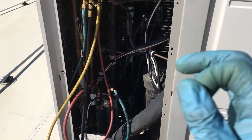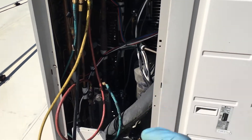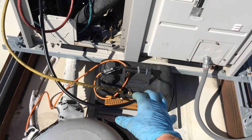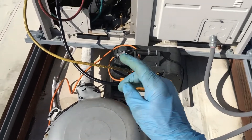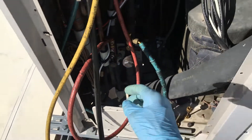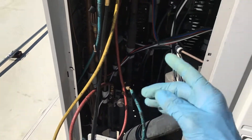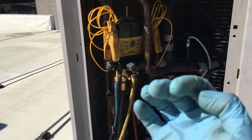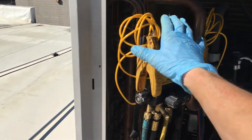But if you want to do a real good job commissioning a brand new, clean, tight, dry system, you go directly off your vacuum pump source, directly through either copper lines or silicone hose, right to your valve core remover, right into your system. You do not use refrigerant charging lines for pulling deep vacuums. But I thought this was worthy to show you something about the micron gauge located in refrigerant manifolds.